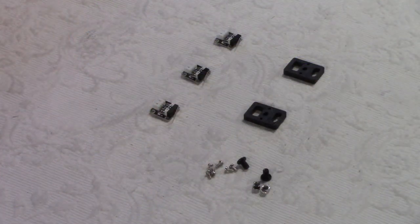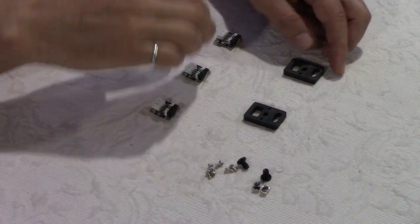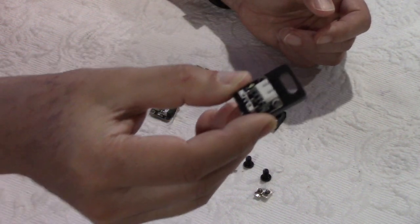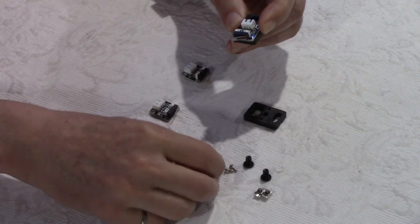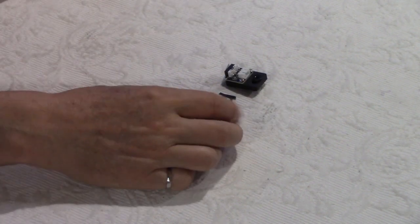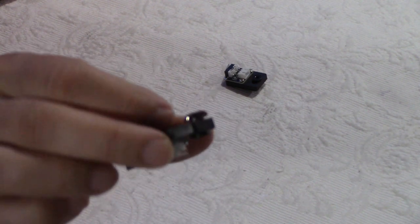For the next step you will need bag B03, which has the three limit switches for the axes. We have small screws, big screws — actually two big ones — and T-nuts. Install the limit switch leaving this slot available for the screw that will lock it on the rail, and use the small screws to tighten the switches. Now we have our two limit switches put together with the two little screws and a T-nut in the back.